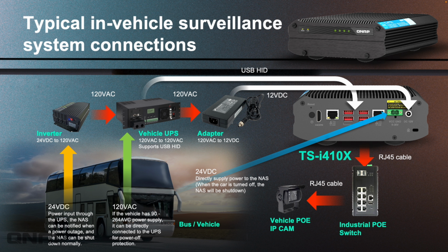As I mentioned, we've got the two power input options. You can see there we've got a green option for the DC power input, or we've got a barrel jack, the DC 12 volt, which comes from our own adapter. Just for reference, that's a screw-in connector, so you can probably tell by looking at the adapter there, there's a bit of knurling around the barrel jack. That screws on over the DC 12 volt connector, so it can't be shaken out or accidentally pulled out. It's fixed in there if you screw that up so that it's really in there tight.